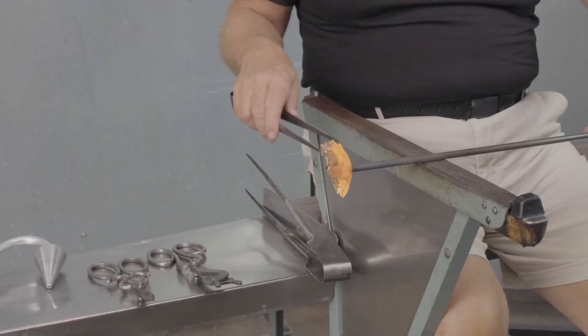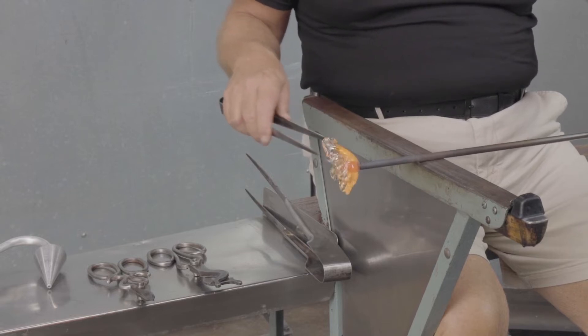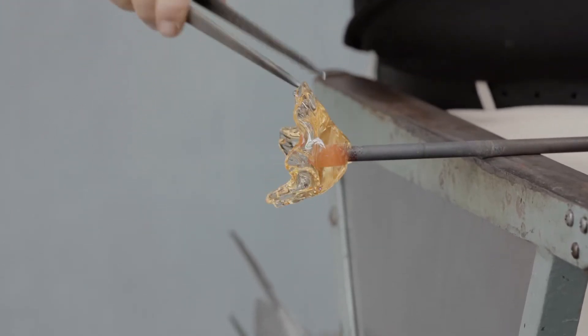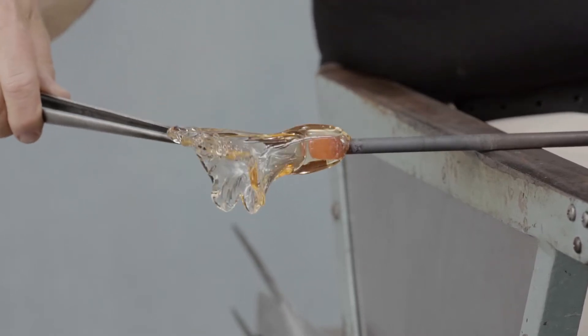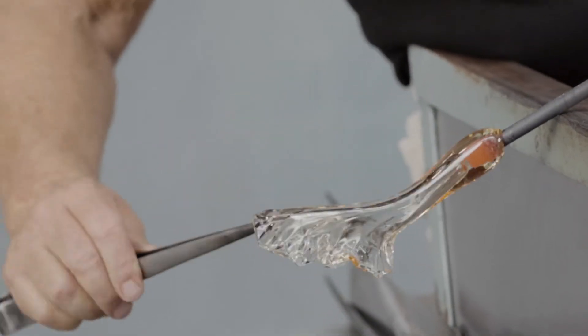In this case, the glass is flattened, the edge is made larger in diameter, the edge is chilled by contact with the pincers, and gradually pulling outward, tubing forms and is pulled from the reservoir near the gathering rod.